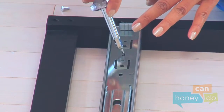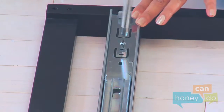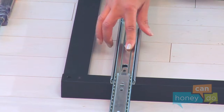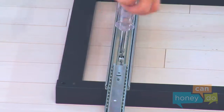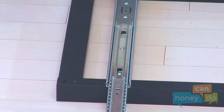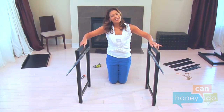Notice the oblong or oval holes in the slides line up with the pre-drilled holes in the table frames. You will need to look through the slots in the slides while sliding them around to locate the holes underneath the slides. When assembled, the left and right slides should face each other.